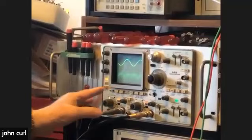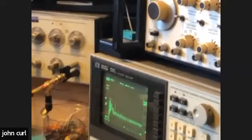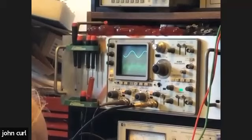And when I go to the spectrum analyzer, that's the same thing. You can see the noise, but see how it's reduced, the noise is going away. That's due to the fact that what I'm doing is I'm averaging the signal that's in real time here, but I'm taking like snapshots. Now, I've set it right now for 10 snapshots. However, if I want to, I can go deeper than that.